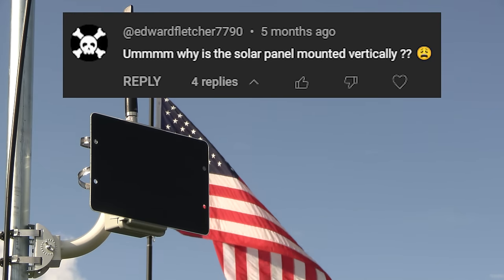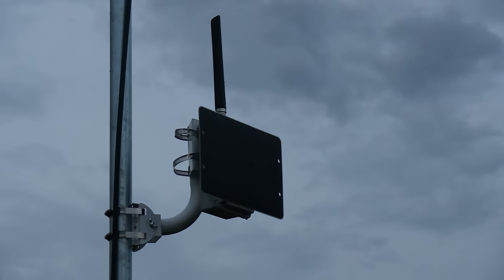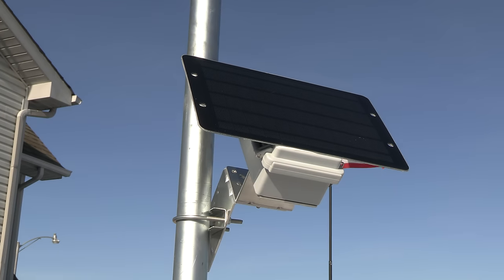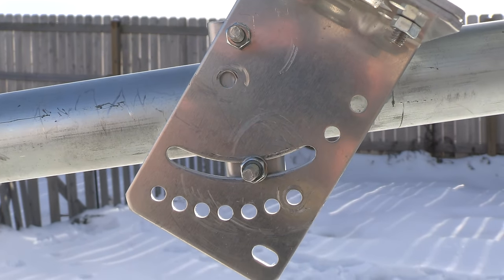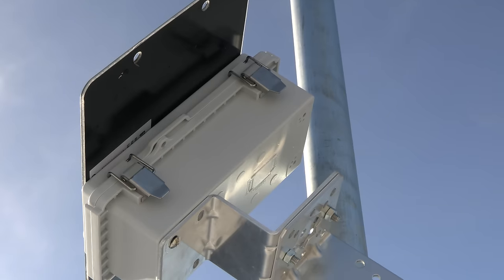I've received a few comments about the solar panel being flat against the enclosure and not angled towards the sun. We've had a number of these out in the field that have been working fine for a little under a year and they've never gone under 80 percent — though I'm in the south, so this may not be the case up north. We have a solution for that with the new build: there's an additional bracket from the same company that mounts to the pole with adjustments for whatever angle you need. There are websites where you can enter your location and it'll give you the best angle for your area — I'll include a link in the video description.